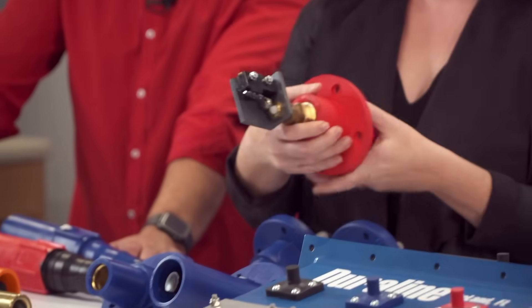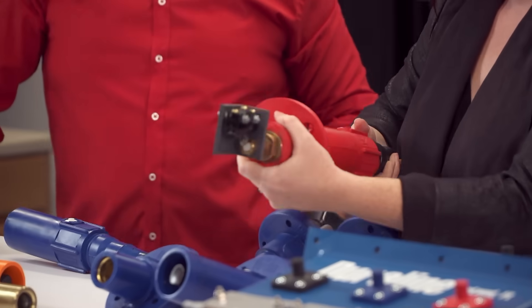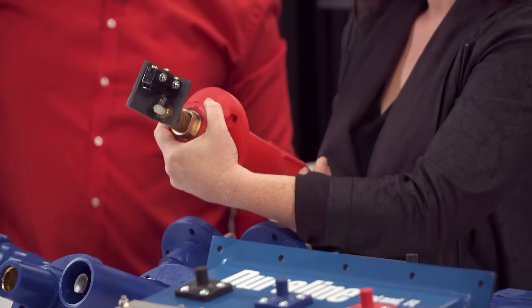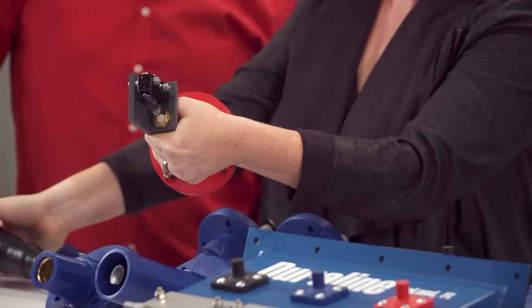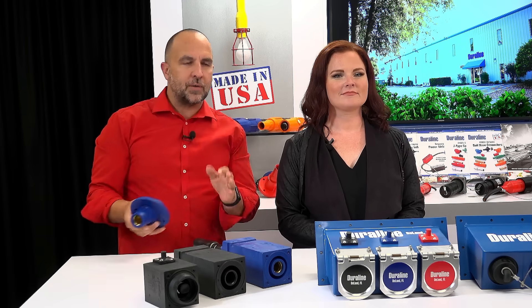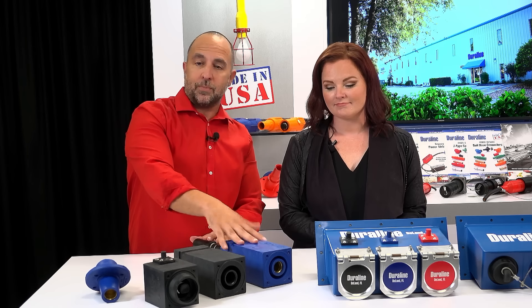This micro switch allows control of the circuit breaker. Until every connector is plugged in, the breaker will not activate. This would be the general use kind of receptacle. After the general use, the heavy-duty receptacles are used for shore power applications, pier power, and ship shore power needs.